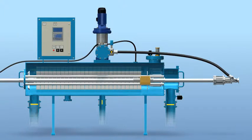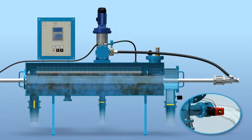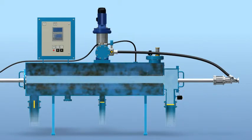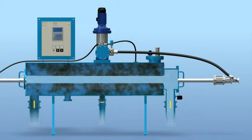Once the spray cleaning of all the cassettes is completed, the flushing and drain control valves are closed, and the inlet and filter-to-waste control valves are opened. Raw liquid enters the filter and fills it up. Air is displaced via the air release valve, and initial filtrate is passed through the filter-to-waste control valve. The filter-to-waste control valve then closes, followed by the outlet control valve opening. The control unit turns off the flushing pump. The cleaning cycle takes up to 10 minutes. The filter is now back on line.